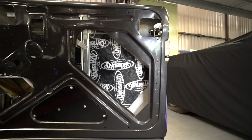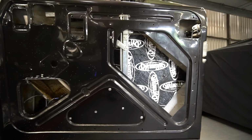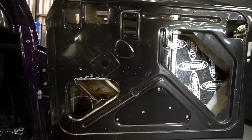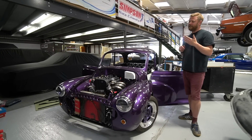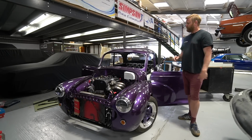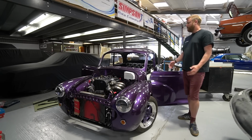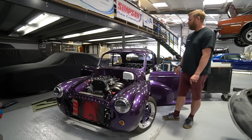I think the current plan actually, because we're going to do them as 2 layers laminated. I can't remember if I've mentioned this before, but one thing we've often battled with a bit when making door cards is where you have the clips coming through holes in the card. The back side of the clip is obviously on the visible face of the card. And although you obviously go over that with foam and whatever upholstery material goes over the top of that, you tend to be able to still see little bumps from where those clips go through. And both ourselves and Dean at Trimworks, who does our upholstery, have always battled with that problem.